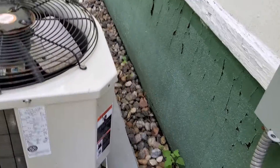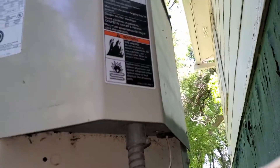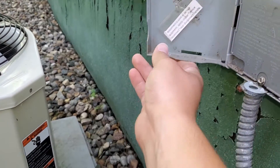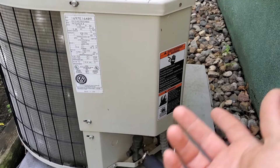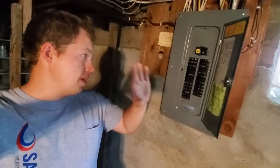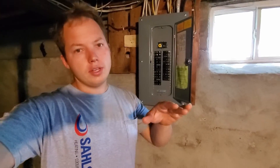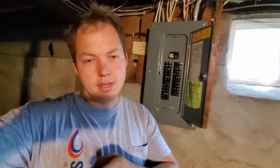then the next most likely situation is going to be some shorted out wires in the side of your air conditioner. Because a lot of times mice like to get up in here and have a party. A lot of times they'll chew off these little thermostat wires, and they'll either short to the frame of the air conditioner or they'll short to each other, which will trip out that little fuse. So before you check anything inside of there, you want to make sure that you disconnect the power to the unit and verify that it is off. To prevent that fuse from tripping — like if you're going to move your thermostat — basically just turn the power off to the furnace, which in this case is breaker number 20. By turning the power off to the furnace, that will prevent that transformer from running, so you will have no low voltage at the thermostat, and you're not going to accidentally short out those wires.